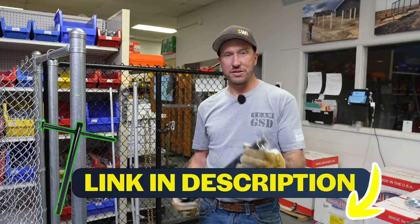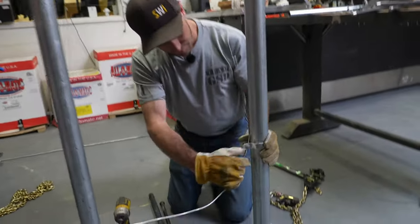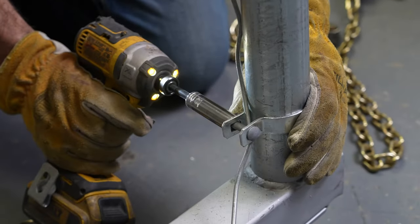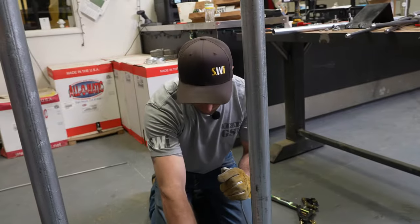We're going to go for the T-handle. Use this for your top barbed wire or your tension wire. I like to put that nut on just a little bit tighter, because believe it or not, when you're pulling the wire through you can actually pop that nut off.